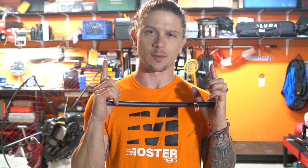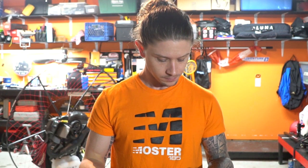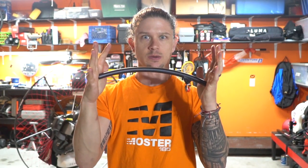All I was doing here was explaining what had happened during my prop strike. If you didn't see that video, I'll put a link above. This is the piece that came off while I was flying. I was replacing the pull starter — that red pulley was damaged from the factory. I had removed the pull starter and tied it off to one of the spars while flying. What I didn't know is that the pull starter tension on that pulley is what holds that bar down and prevents it from vibrating up and going through the prop, which is what it did.